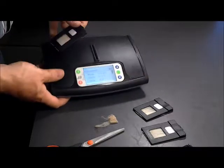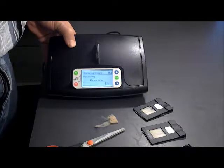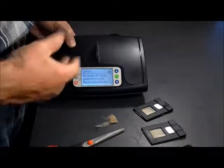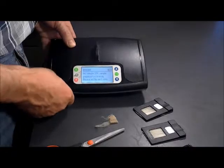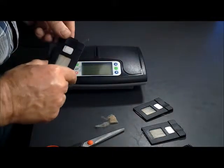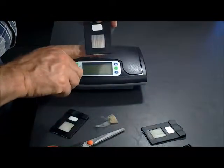Now, if you prepare the sample too dense, you would get an error message. The same error also occurs when you do not have enough fibers. If you look at this one, you can't really see through it. It works on a light principle, so if the light can't shine through, you can't get a measurement. On these, you can see through. For consistency, please try to get your samples to the same density every time.